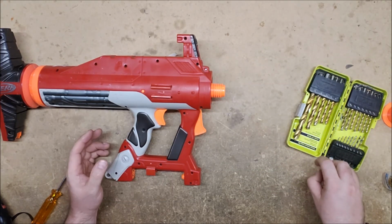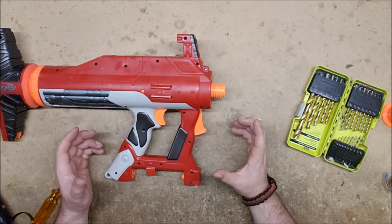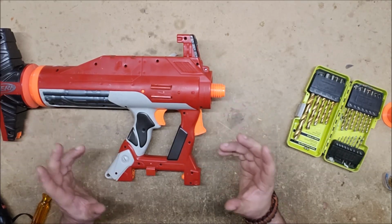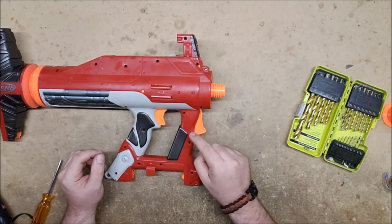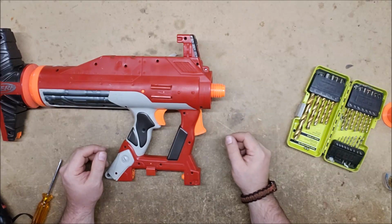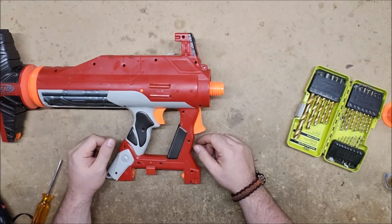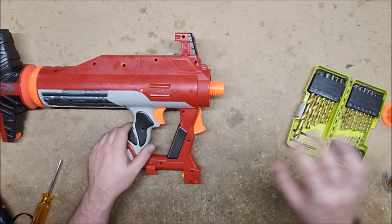This one, it was very obvious where the leak was. The hose had popped loose. If it's less obvious, if it isn't like a whole hose is broken loose, what you'll generally need to do is take the whole system out and pump it up underwater so you can see where the bubbles are coming out. And then you can try to glue or seal or replace the tubes or what have you in order to seal that up. So there you have it. This is up and working, and we will get it back to whoever sent it. On to the next one.